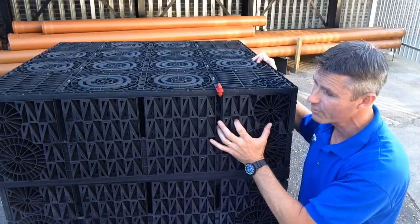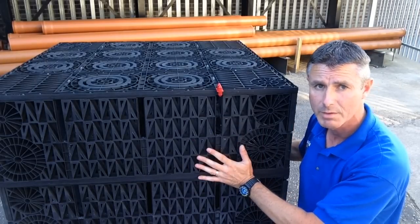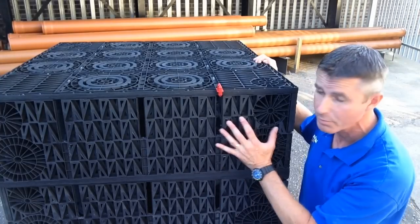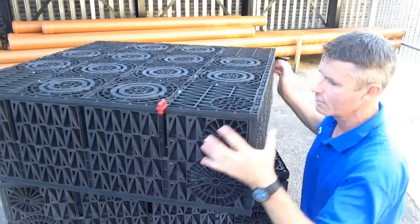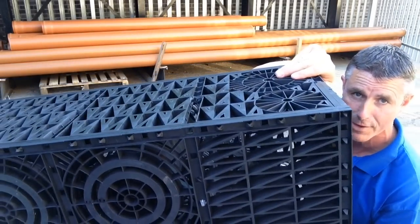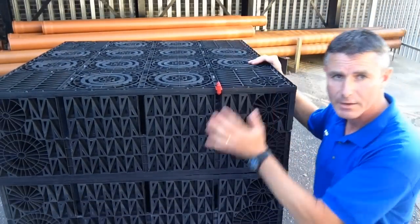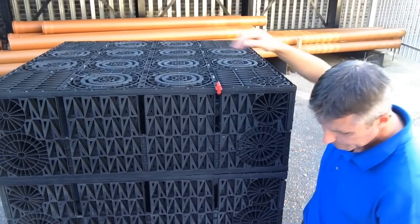They're really flexible. That's the great thing about soakaway crates. You don't have to have them like this. Most people do have a 1 cubic meter, but if you had a larger area, or perhaps you wanted to build them into a different area, you can actually put them side by side. The only way you don't have them is with the, let me show you, that way around, so that the 333 is on its edge, because all of the strength is horizontal. So you always have them stacked on top of each other, or in on a single level side by side.